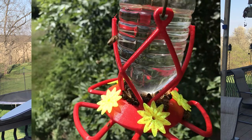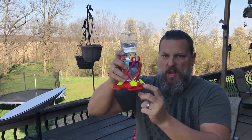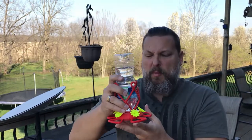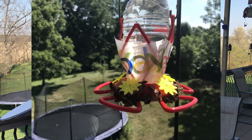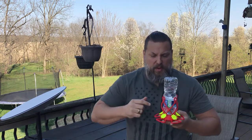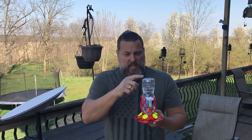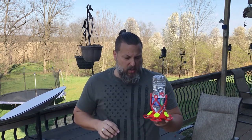I had a little problem last year with bees getting down in there early on, so I've added a small ridge to help keep bees out of that area. I've also had problems where the print is a little porous and somehow the bees can suck the juice through the plastic, so you've got to make sure you have a really solid print. I print these in PETG — this material is basically the same as soda bottle or water bottle plastic, very temperature resistant and relatively easy to print.